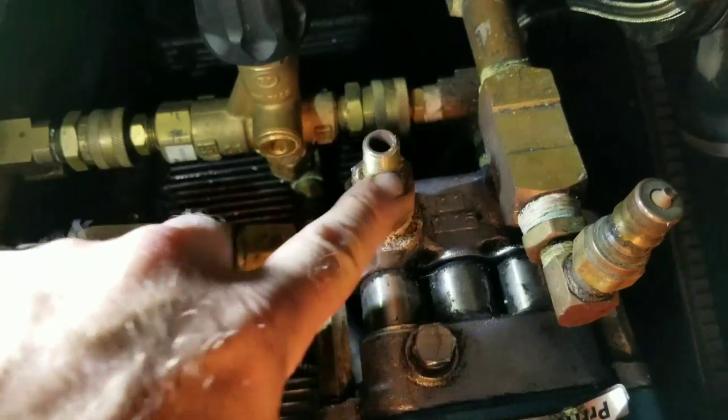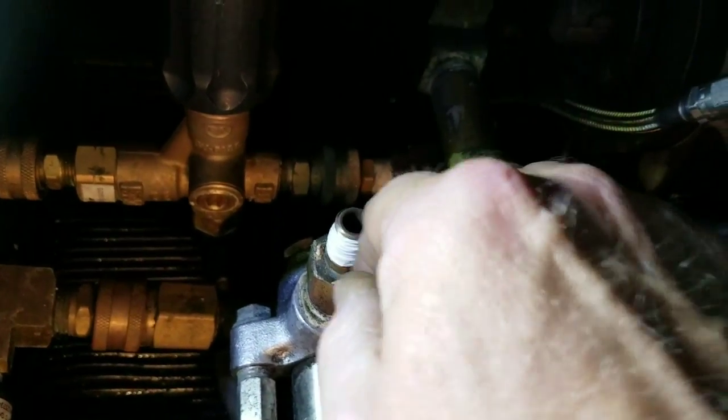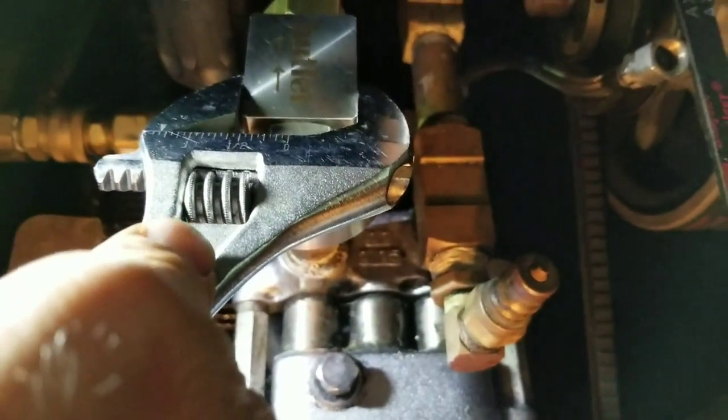Before we put that chemical injection pump back on, we're going to have to do some teflon tape on that little nub that's left there going on the cat pump. We're wrapping on there - just want to give you an idea which direction to go. We're going to get our chemical injection pump - remember the arrows, we want them pointing that way when we arrive at home base. Sometimes you have to back a thread up a little bit just to get it going. Once I get it in place I am going to snug it pretty good, but I want to set it so remember that bleeder hole - that's over on this side of the van towards the front.